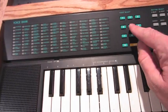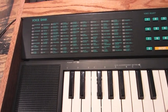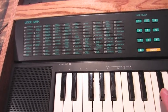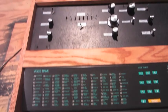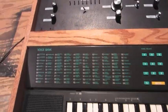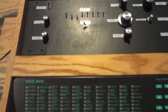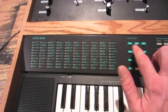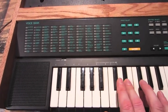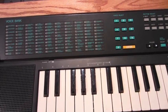To do this, I'm only going to use two sounds, number 54, which is leaf spring, and number 33, which is gurgle. Pretty two different sounding. So right now we're on 33. I'm gonna shut a few data lines off, which route it to here. Then I'm gonna select another sound, 54, turn those data lines back on. And now we have somewhat of a mixed sound.